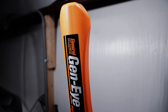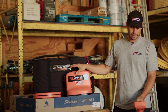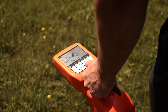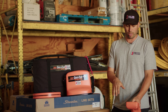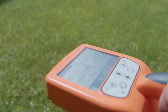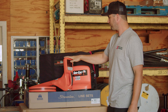The second tool in the kit is the locator wand. It pairs with the transmitter, and you wand around the area where you think the underground line is. It tells you the approximate location within a few inches and also gives you the depth of the line — so if you're doing excavation or putting a fence post in, you'll know how deep the line is. Those three parts — transmitter, locator, and ground rod — make up the kit.